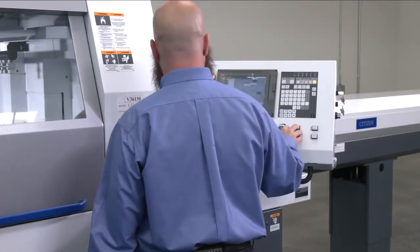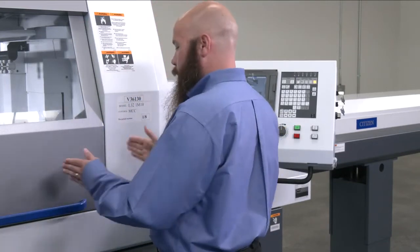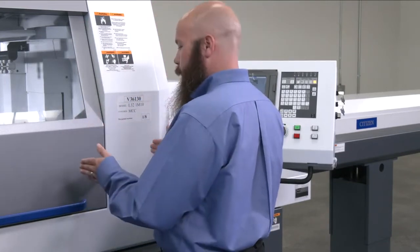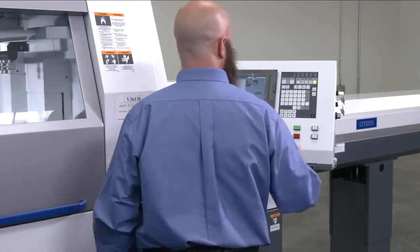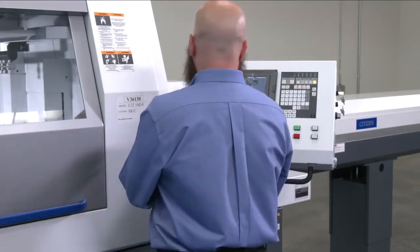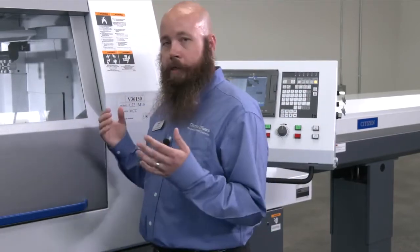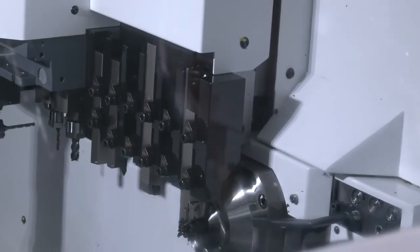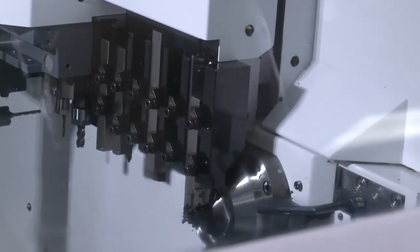So at this point, I do what's called a start position. The headstock drops back to the machining data length, or the machining length, which is your total amount of material used to make the part. So let's just pretend that that was the last tool that we set and we're ready to check this setup, this program. Cincom offers an operation mode called program check.